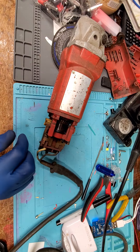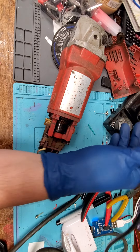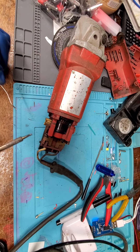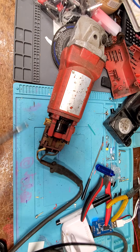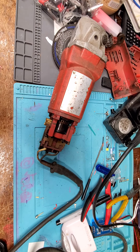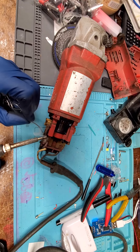I haven't done it yet — letting my iron warm up. I got one of those big clicky gun bastards but I don't want to use that. I got my FAKO 852D Plus over here, soldering hot air station — yes, s-o-l-e-d-i-n-g, I've mentioned that many times. I'm just gonna use it cranked up to like 480 or something, hopefully that's enough to get her done. I should probably put some flux on that. I did clean it with a wire brush a little bit but I don't know if that's gonna help. It might not take at all — it's copper, brass, whatever. Guess we'll see.